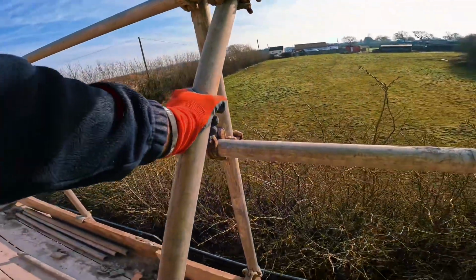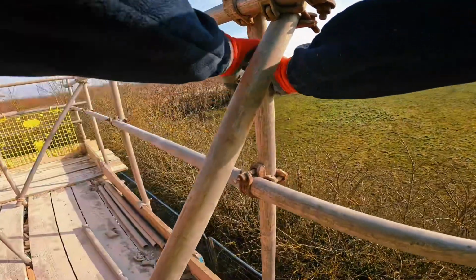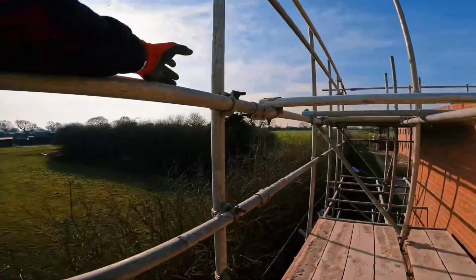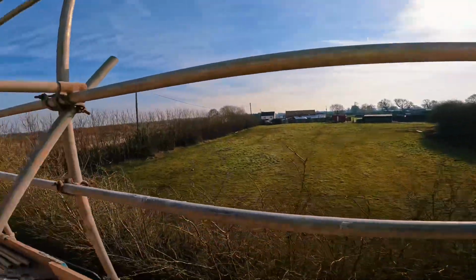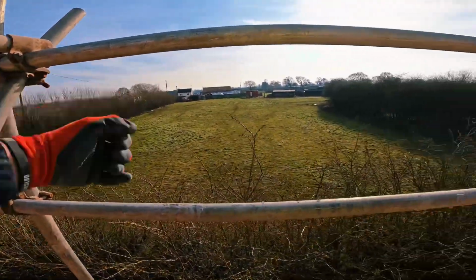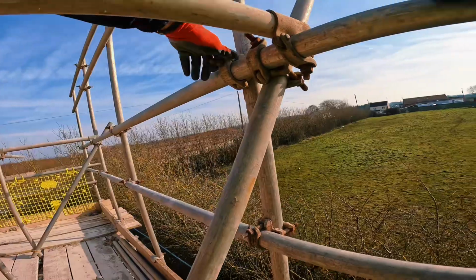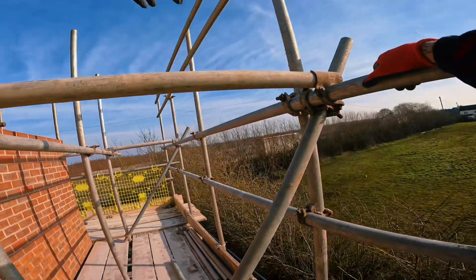So by your second lift, when you install your first swayer, tighten all your swayer up, get your legs level with your swayer, tighten your double off, it's above your swayer, then you can go back along, loosen all these, level every leg back in, and you're good to go. That's basically what your swayer's for. People seem to think your swayer's to stop the job shaking about. It doesn't, it's to level your legs in properly, so all your legs are flush all the way down, because once one's tightened, the ledger is all the way down. You just adjust every leg without the ledger moving then.